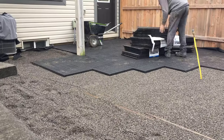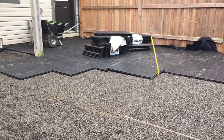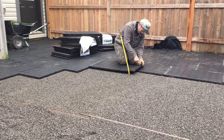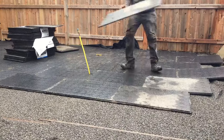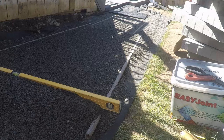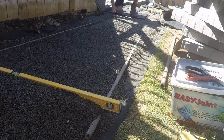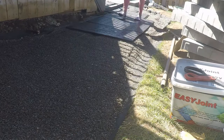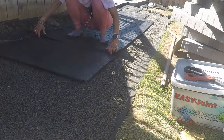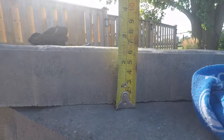The main reason why I like it is because we do a lot of tight access projects. Sometimes we can't even get a piece of equipment into the backyard to do our excavation, which means a lot of labor. But with our synthetic base we can reduce that excavation by at least half. That means with a typical project we would do a six inch base, one inch bedding layer, and then our pavers of two and three-eighths of an inch. But with the synthetic base we're doing a one inch bedding layer, three-quarters inch for that synthetic base, and then our two and three-eighths inch pavers.